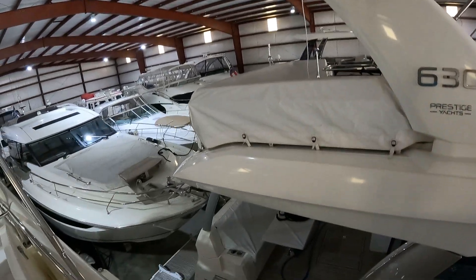Once all these boats are packed in here super tight, this is indoor heated storage, so these boats won't need antifreeze or glycol mixture run through them like you would if storing your boat outside. But they will still disconnect the batteries so they don't drain and leave you with dead batteries in the spring. Additionally, they're going to clean and drain the bilge — making sure any water or debris is wiped out and sucked out with a shop vac. The hot water tank will also be cleaned and drained. No sitting water, no worries, and your boat will be nicely tucked in for storage all winter long.